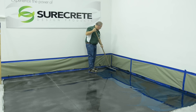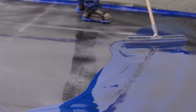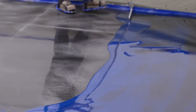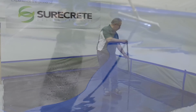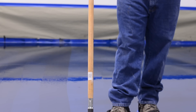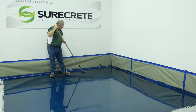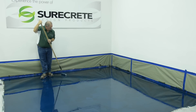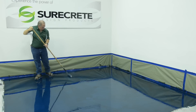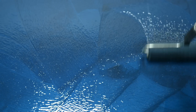Tracking coverage is essential to achieve the desired three-dimensional look. Coverage should be between 40 and 70 square feet per gallon. This metallic coat is back rolled just as the primer coat. After back rolling, randomly swirl the metallic coat with a smaller roller in no particular fashion — the swirling motion will soften as the pigments settle into a pleasing patina. Working time for this process is approximately 15 to 20 minutes.